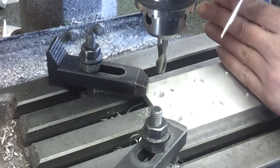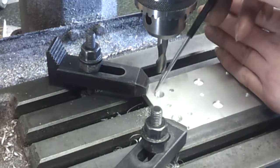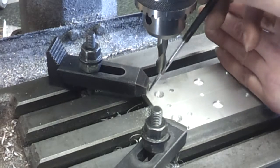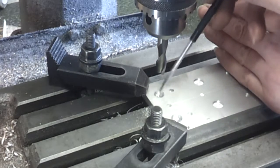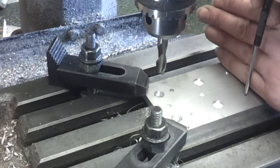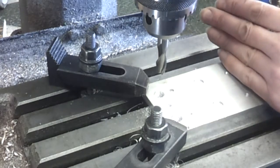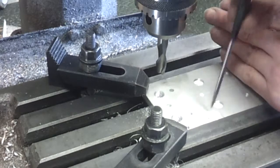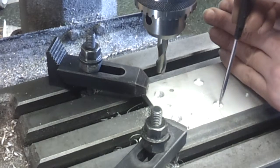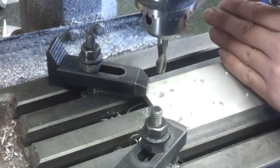In case it's not showing up on camera, I've just got two 5mm holes going through the plate here — or not quite, because I don't want them shooting to the bed, but I'll drill these out separately later — and then a 10mm counter bore going down 4mm. This hole and this hole over here are going to be the guide pin holes for the top plate, a couple of magnet holes here if I need them, and then these are the important magnet holes for holding the section in the middle to make that all-important slot for us.